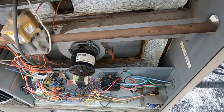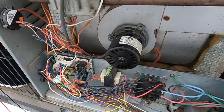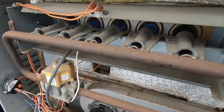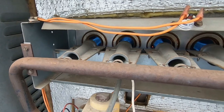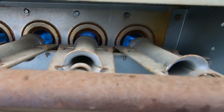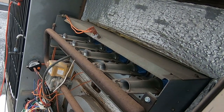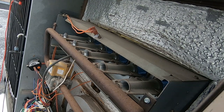All right, let's start over — see if you can diagnose it without the blinky blinks. Just got to go back to old-fashioned elimination. First thing that usually happens is your draft motor. There she goes. Check the filters on this beast — I'm pretty sure it is a direct drive blower, but we'll check to see if it has a belt or not.